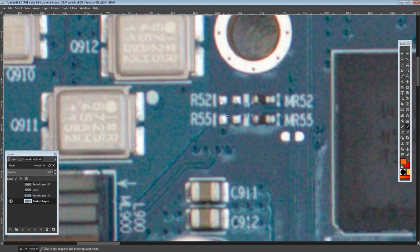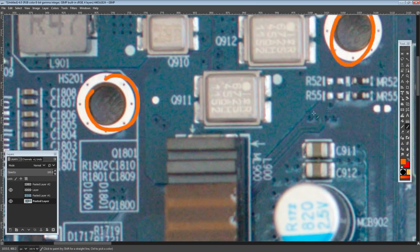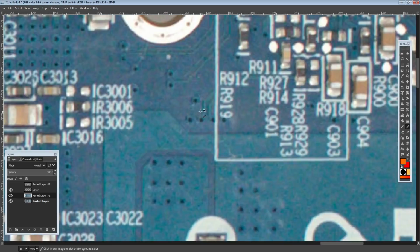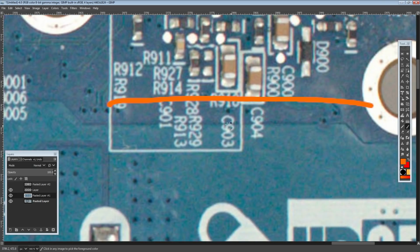So those are very suspicious, and conveniently we can actually figure out where these go through. And here they go through the PCB, right? We can see the vias right there. We can use the screw holes to get an idea of relatively where they're located. So if we go to the back of the card, I think I see our vias, right? These guys over here. There's 4 of them. They're relatively close to that screw hole.